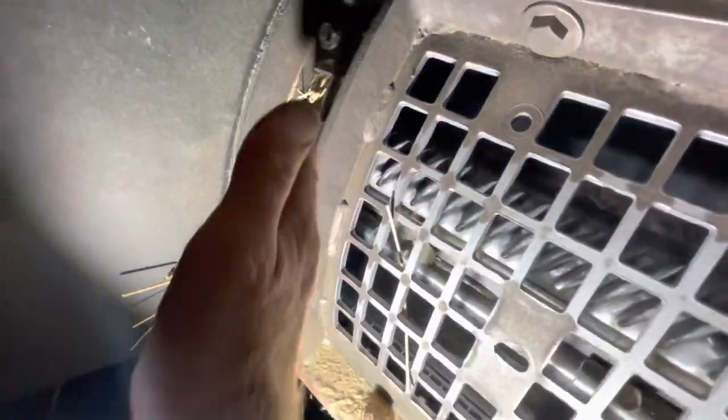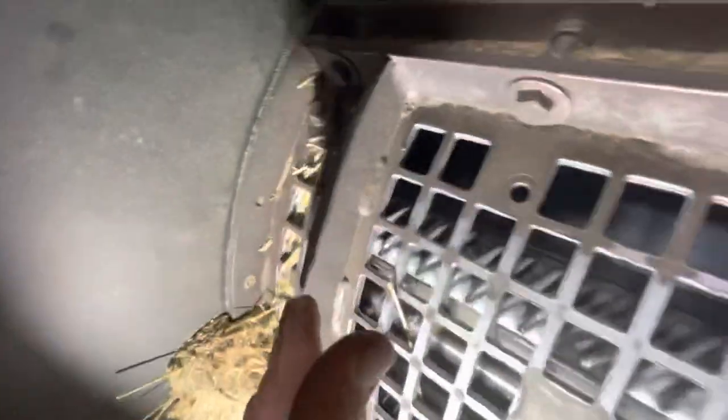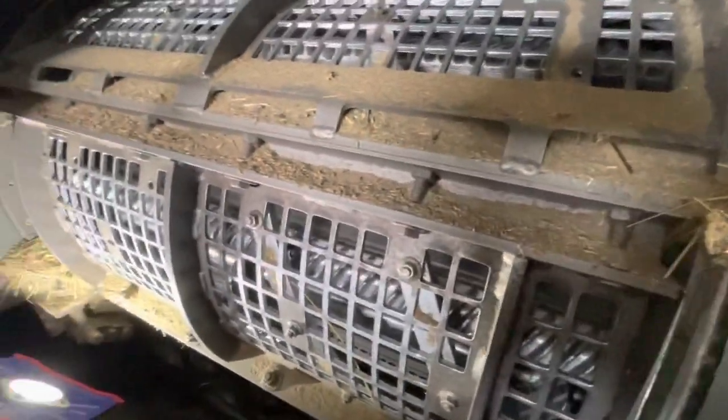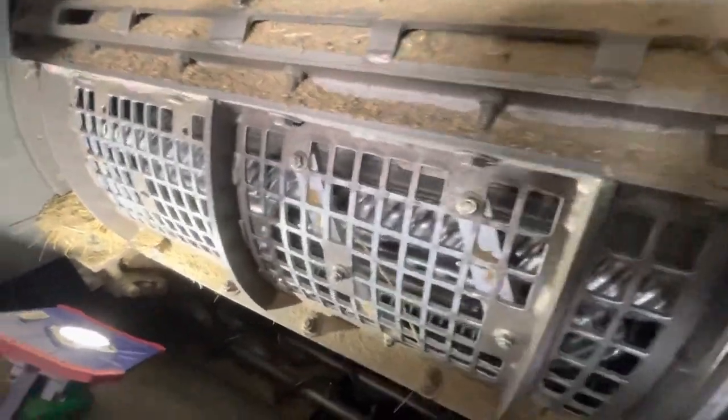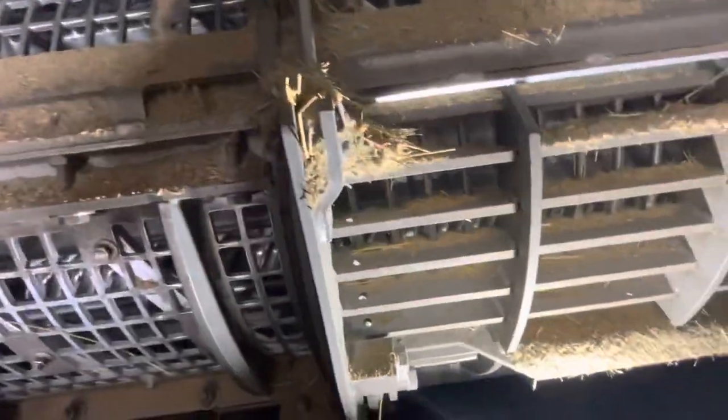if I can get my light to stick, I had several guys suggest to me to put in what's called a corn dam. It's just a chunk of helical bar running straight up and down. It just helps to kind of slow stuff down. It actually helps stop any corn from going around the corner and being thrown into the chopper. But yeah, that's just some of the modifications that I have done on this R72. And I can tell you one thing, it has made a big difference in green stem soybeans.